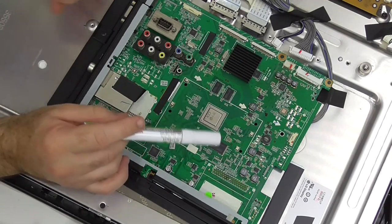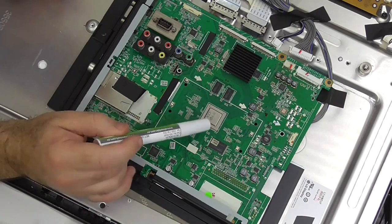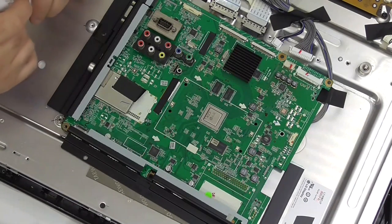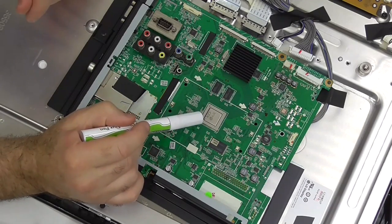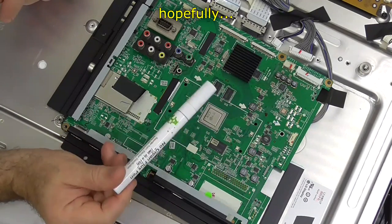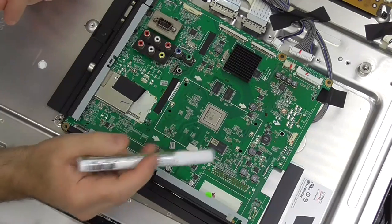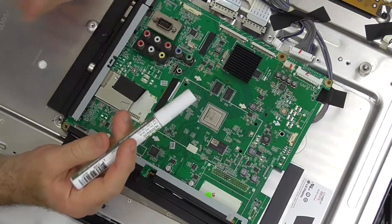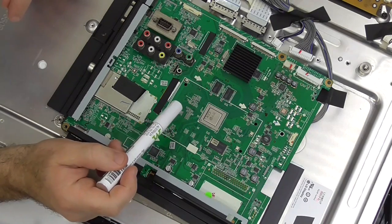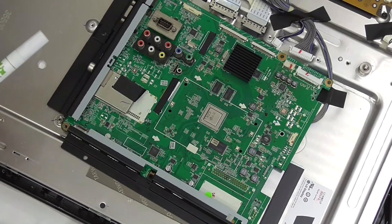What I've done is put some expired solder paste - just some dabs in the corners and in the center of the chip. Overdid it a bit there, got rid of what I could. That's going to help act as a gauge for the amount of heat I'm applying. All I need to do now is use my flux pen to get in under the balls, going in from all four sides and basically bathe it in flux. The act of heating it up should get rid of whiskers and any cold joints - in theory.